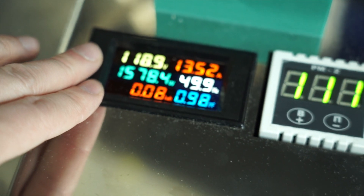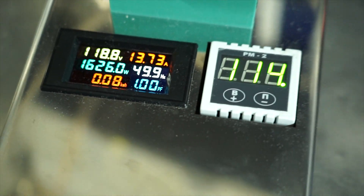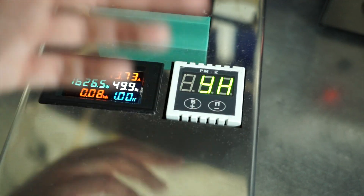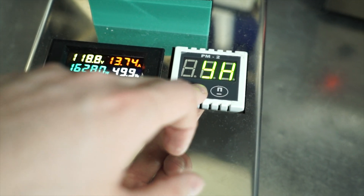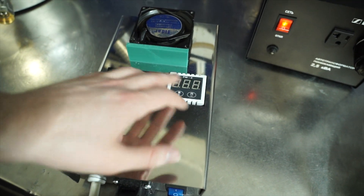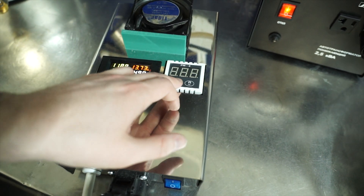It's a very accurate controller. If you go higher, the regulator won't have enough power to stabilize, so that's why it's flashing. If you have more than 125 volts you're able to run it at a higher voltage — just be aware that you can burn your heating element. With low voltage that's not the case, but if it goes to 150 volts you probably will burn it. At 120, 125, 126, 130, 135 volts you probably won't have any problems.